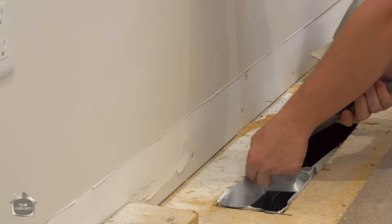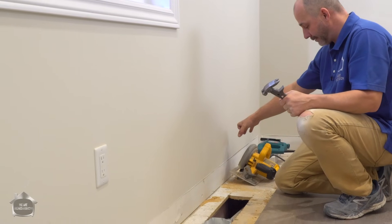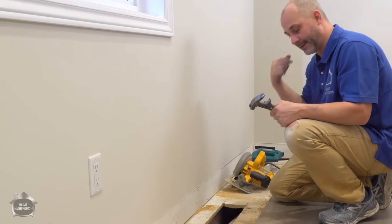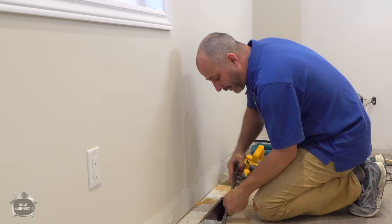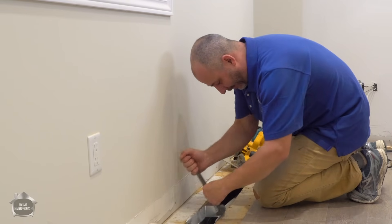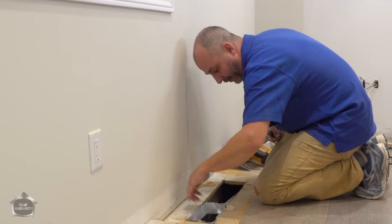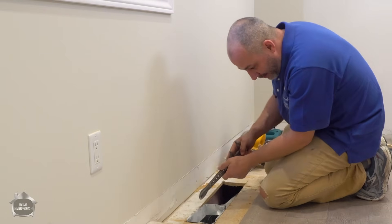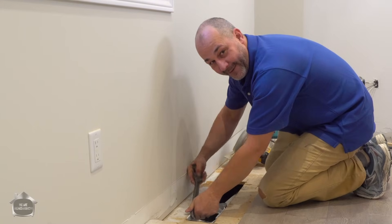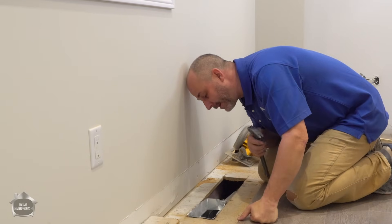It's not always that easy to just open a floor and move a vent. In this case I was already aware there's a mechanical wall downstairs right in this location — we opened up the floor earlier in the project to run some electrical, so we already knew where all the ductwork was heading and what our allowances were. If you're not sure what's going on, just reach down — generally it's coming from one direction or the other — and you can always open the floor and find out if it'll work. If not, buy a smaller dresser.